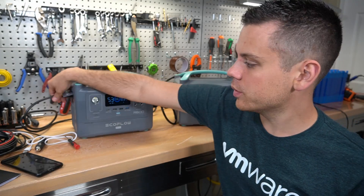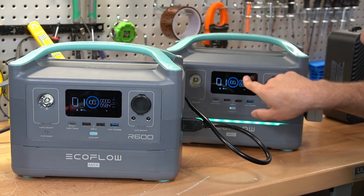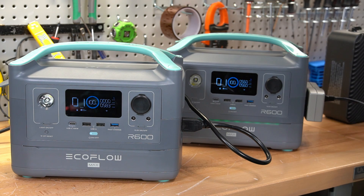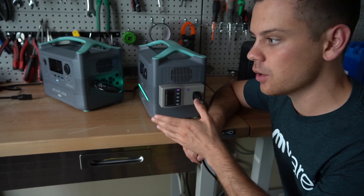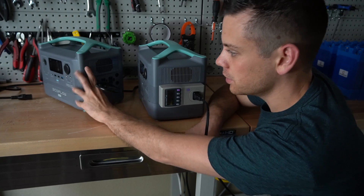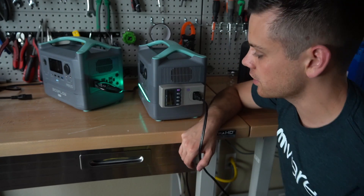Now they're fully charged. We disconnect the charger and add a 600 watt load. It's actually working — it's charging one unit and powering the load. Let's come back and see how many kilowatt hours we have. While I was gone, it turned itself off at 480 watt hours. This one is completely depleted, and this one is at 92%. So we're going to continue the test.